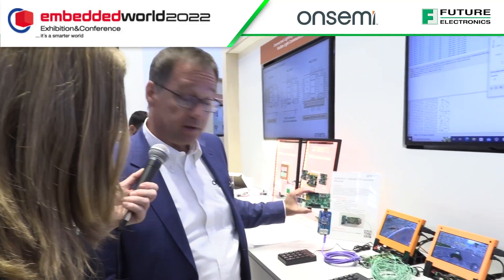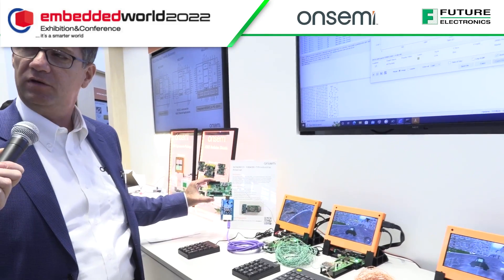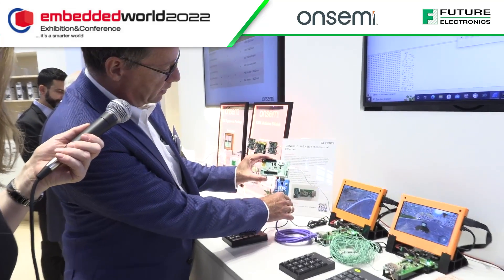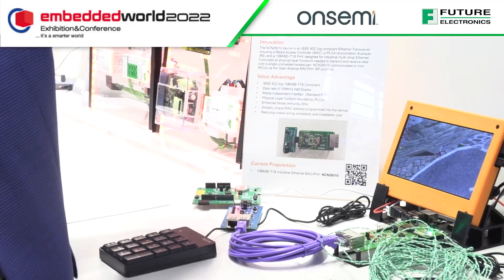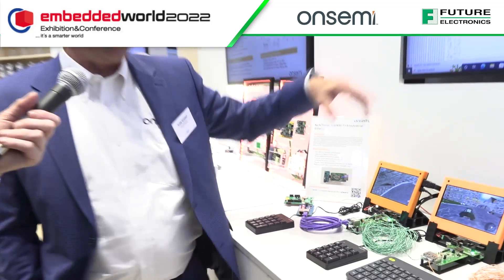To show this works with something less powerful than a Raspberry Pi, we have this RSL10 device — an ARM Cortex-M3 with Bluetooth and Bluetooth LE radio. We use that demo board and implemented a driver over FreeRTOS. We can ping this device over the 65 meters and it will respond. That's all I can show you — quite impressive, thank you very much.